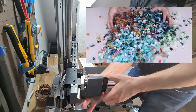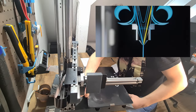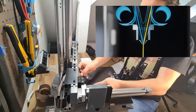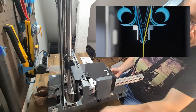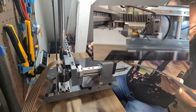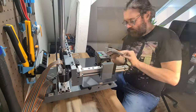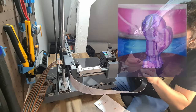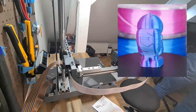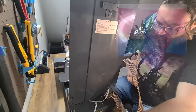And that's where the Cetus II comes into play. The engineers at TierTime have been able to move the filament change point much closer to the nozzle. They achieve this by creating a V-nozzle that contains two direct-drive extruder paths, which meet a few millimeters above the nozzle tip. This allows the extruder something they call on-the-fly switching, which should reduce the size of the purge tower by a lot. Additionally, TierTime claims to be able to mix two filament colors and blend them together, which is also very exciting.